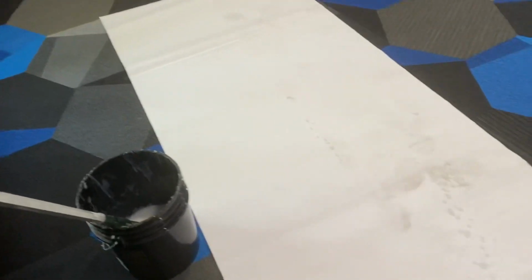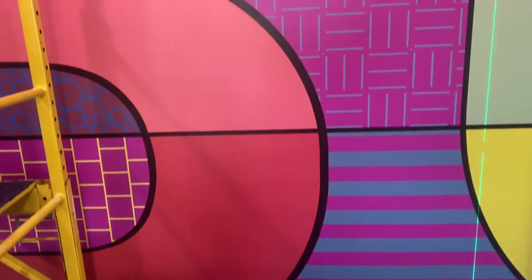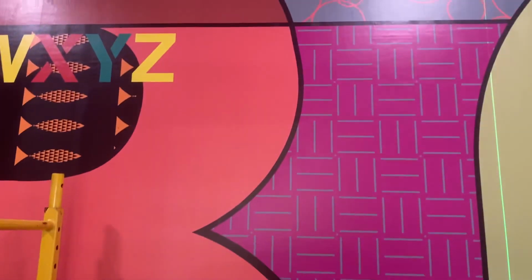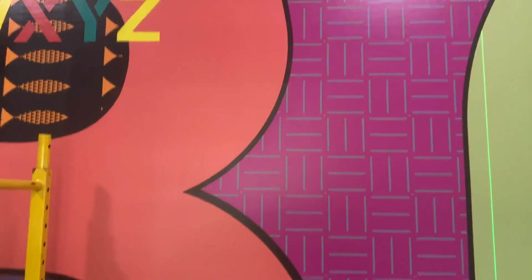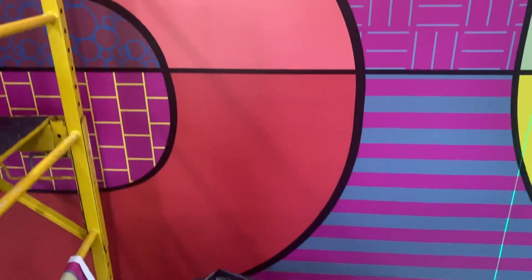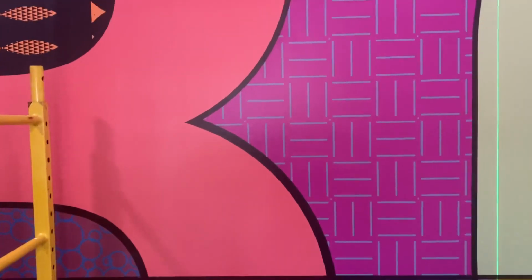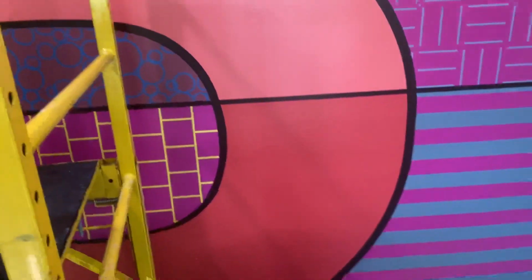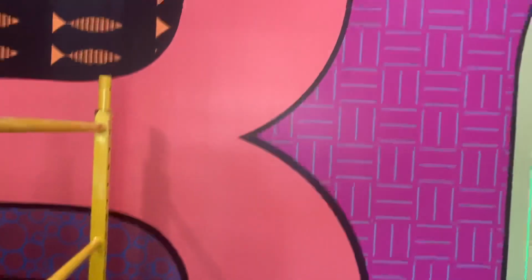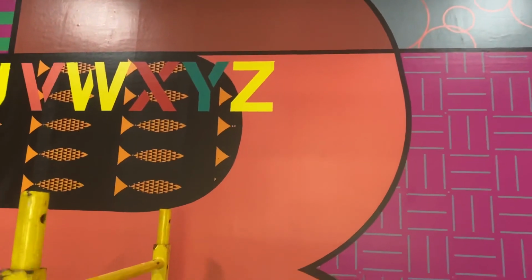It's a good way to get any debris that might be on your product if you're pasting on a table or even on the floor. With the air conditioning on, keeping it at a nice temperature, I like it at 70 for the wallpaper, so that it can do its thing as I'm on the job. And if any bubbles come up, the temperature is important to make them come out. So I keep it at 70. As you can see, the seam looks gorgeous.